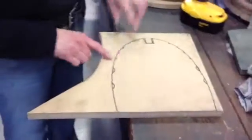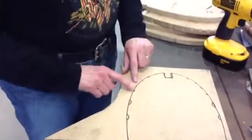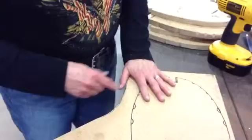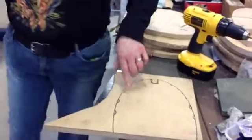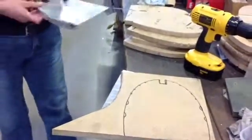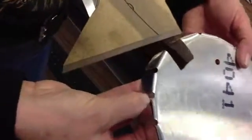How do you make the actual pattern? What were you doing right here just a minute ago? I want to know where my holes are. It makes it easier if I drill the holes first, so that when I lay my flat piece of aluminum underneath it, I will drill my holes — because your hole extends up into the radius of the rib. So you're drilling holes, and then you drill holes into the aluminum. Right.